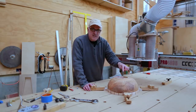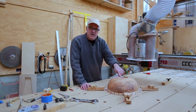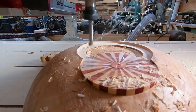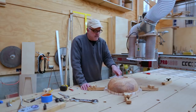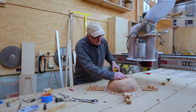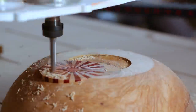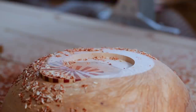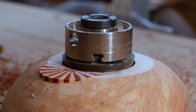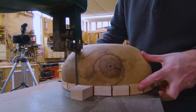I can put these inserts in, but I need to cut a new mortise into the bottom of the bowl because I intruded into the mortise with the insert I made. I want to flatten the rim of that mortise and make the new rim at the height of the insert, since I sank the insert slightly deeper than the rim of the bowl bottom. I need to figure out how big a circle to draw for the area to flatten — looking at where the plane of the insert and bowl cross each other, it's about three and a half inches for the radius, so an eight-inch diameter circle should cover the area. I can cut that flat area and the new mortise, sneaking up on the size until my chuck fits exactly perfect.